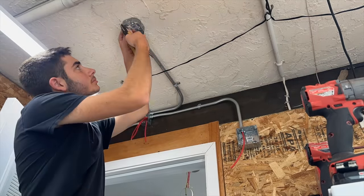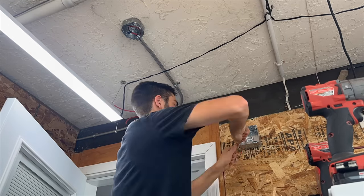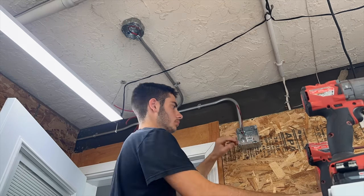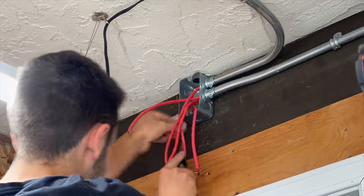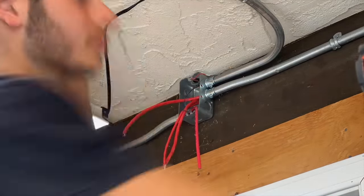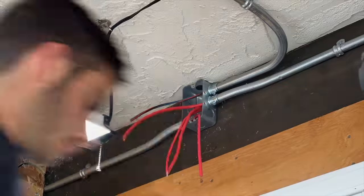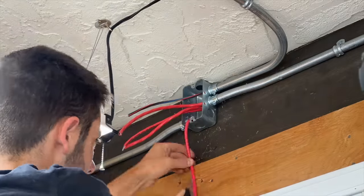I pulled a 4 conductor. And by 4 conductor, I mean really 3 conductors you can actually use, because you can't use the ground in it, because you need that as the equipment ground. In this case, you wouldn't really, because we have the EMT, but I want to keep the colors normal and I don't want to start using a green as one of my conductors that I'm used to carry communication. So I will replace it with a 5 conductor.